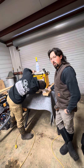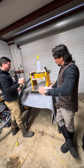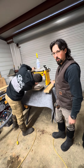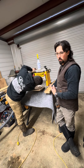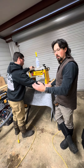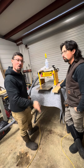One of the main reasons why your planer rollers might get dirty is if you don't have a good dust collection system — you're not sucking all your dust out while you're using your planer. As your board goes through, all the dust and material you're planing off gets smashed up into your roller. Especially if you're planing down pine or any type of wood with a heavy resin, stuff is going to stick to your rollers, which then won't let the rollers pull the boards through. And you can't tell me you've never had your discharge tube clog up from all those sawdust shavings.